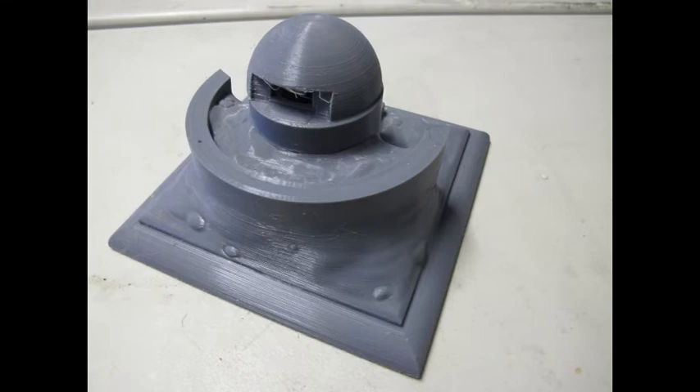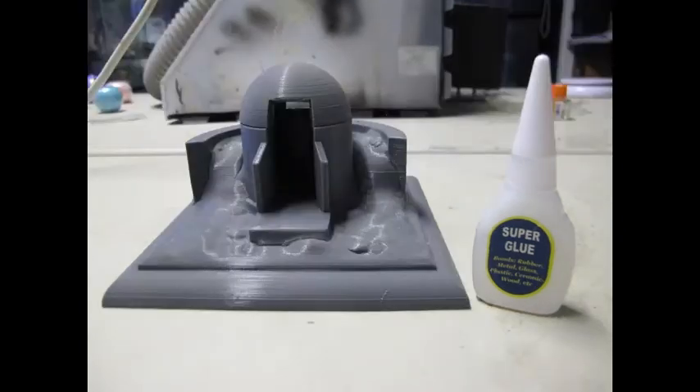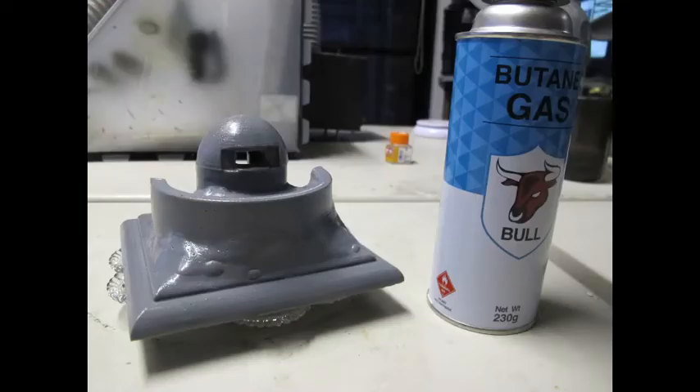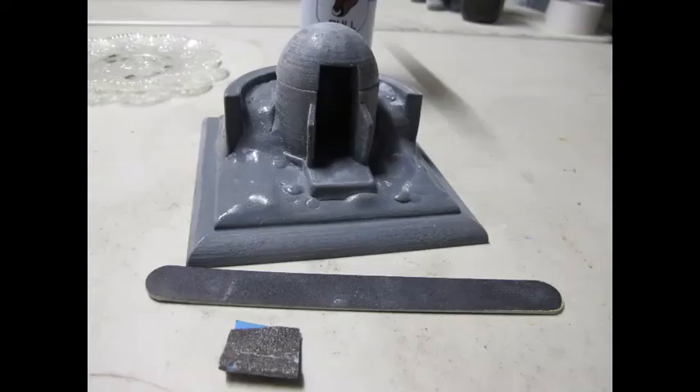The processing started first by using a butane torch and heating the surface very softly to melt the plastic a bit and watch the Z-axis lines smooth out to a flatter, shinier surface. This only works on large, not very detailed surfaces — there's a lot less to sand. Some air bubbles will develop, and distortion or caving in of walls is possible if the print is too thin or you're melting it too much. It can burn as well and let off fumes, so be careful. Experiment on a cheaper, nastier model first.